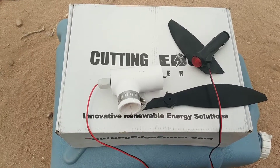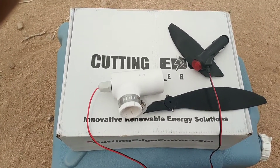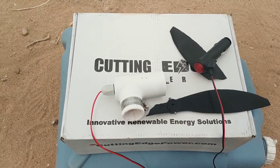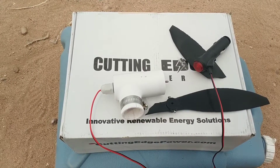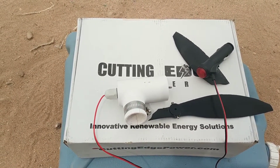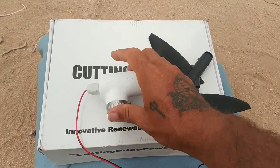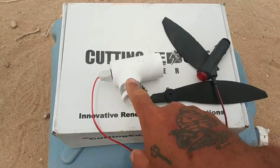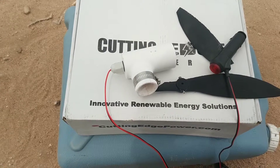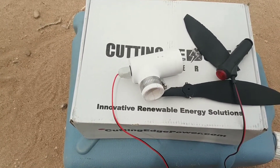Final thoughts: I'm really disappointed. I was really hoping these would provide that little bit of extra power overnight and during rainy days. I'm sure a wind turbine will — just not these. I'm a big supporter of American-made products and it really hurts when a product doesn't perform. I'm going to continue testing and try different charge controllers to see if that's the issue. What I would recommend to the manufacturer is to redesign the housing — model some ridges along the edges to reinforce it. Perhaps this was a bad batch of PETG. Three different prints, same issue — unlikely, but possible.